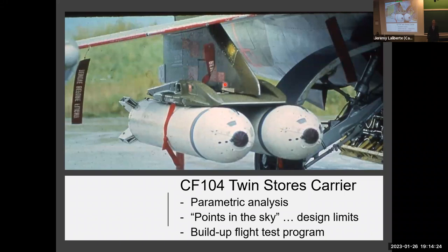The only way we could test this — I remember doing one sequence in a chase airplane — we were gradually building up the increasing G and increasing forces on the tail. Basically I'd take a look at the fuselage and you could actually see the wrinkle. 'Okay, don't get any worse yet. Bang! Still looking good.' We'd get to within what we thought was a limit, then land, and the technicians would bring out rulers and physically measure the wrinkles to make sure they didn't grow. You're supposed to yield at 115 percent of design limits — that's permanent set. Well, all the aircraft had permanent set right there. You just didn't want to make it worse. It was a pretty wild way to do things, but that's how I got introduced to what I guess is called pragmatic engineering. If you didn't get creative — or nowadays the buzzword is innovative — you'd be stalled. You would never get that clearance.